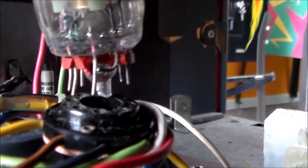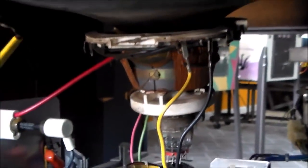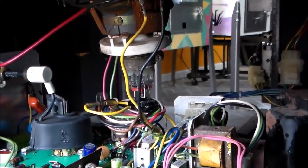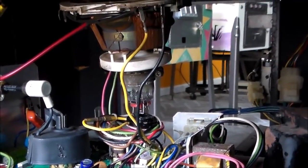Man, what are they doing to me here? So, whoever put this back on, can you see that one pin, how it's bent over out of the way? It's not in the right spot. I don't know if it's focusing properly. See, the one pin is bent sideways. So that's definitely an issue. I'll try to carefully bend that back and then slide the socket back on it, and we'll see what we get.